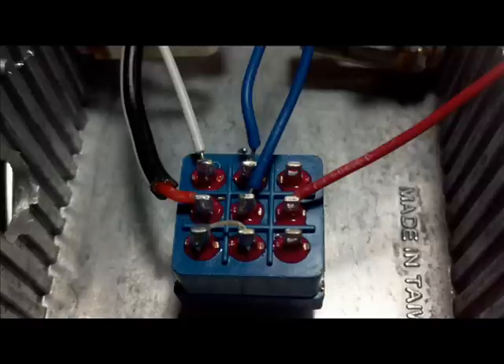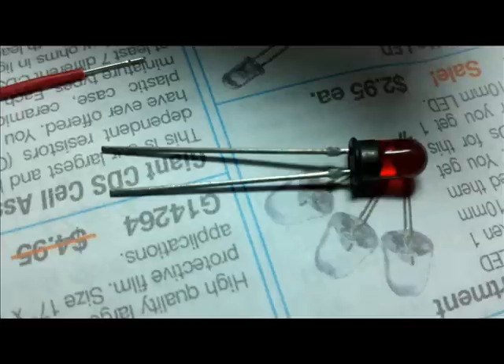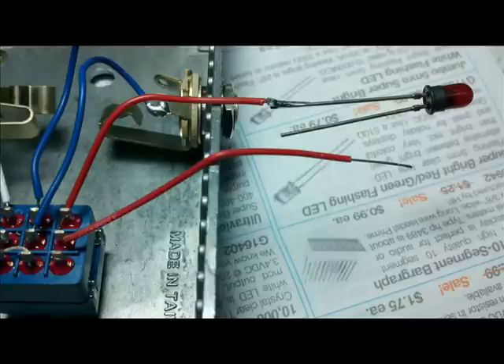So there you have all the wires. Next, on the right we're giving nine volts of power and that will power up the LED if you choose to use one. Notice the top end, which is the positive, has a long pole — we solder the red wire to that. The shorter pole goes to ground; we solder that to the top.